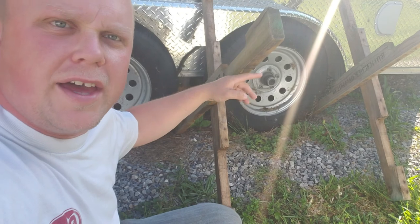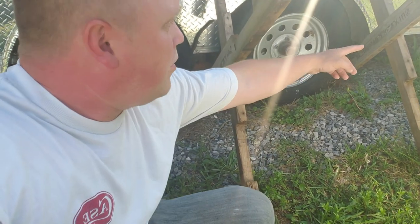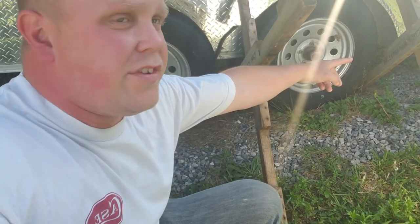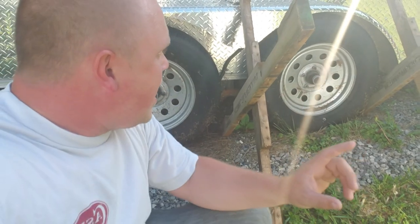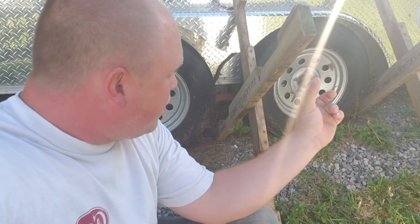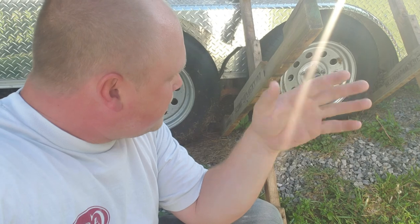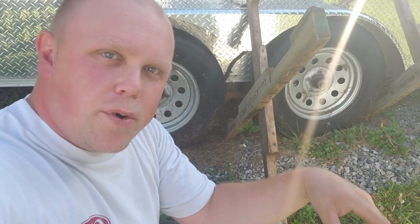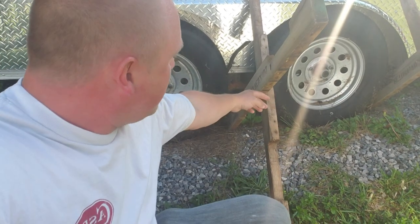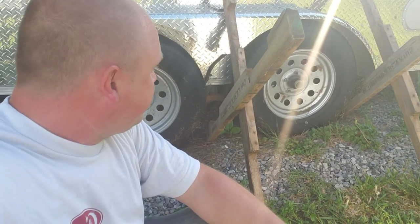Now on this underside, coming up under here, going across, we're going to put slats, and those slats, the bottom will be open, the width of a 2x4, and then I'll probably put maybe 4 inches or so, something like that, maybe the width of a board, spacing, and go here, like that, all the way up.